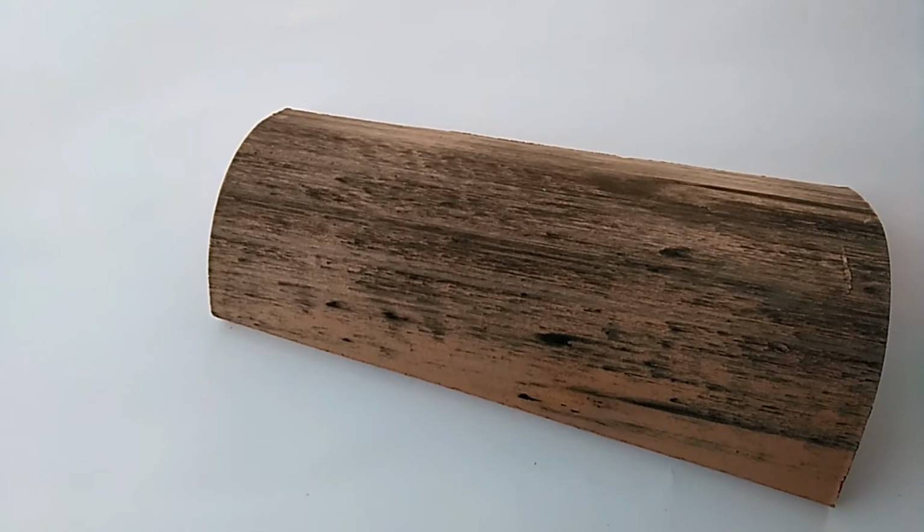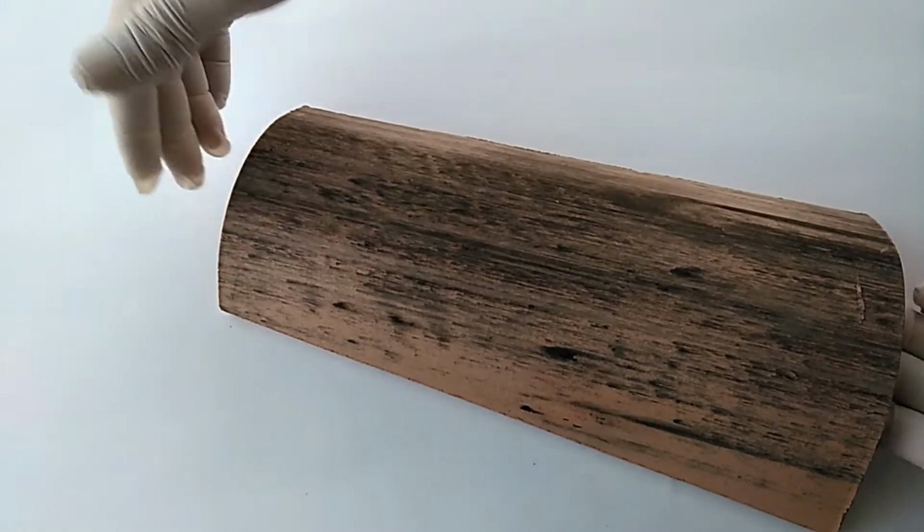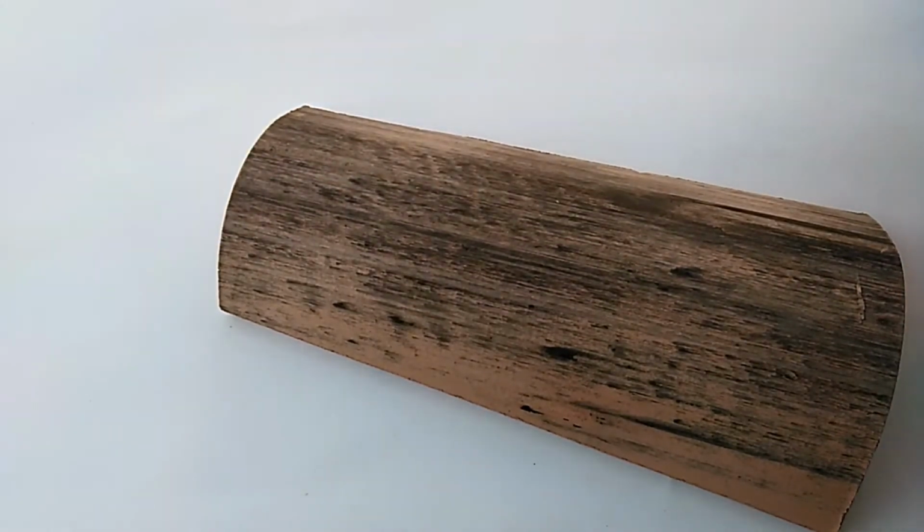As you can see here we have some tiles. We are going to give them a white rubber primer, also known as anti-leaks. In this case we apply the primer with a foam rubber roller that does not lose hair. As you can see the rubber is very dense, that's how we need it, so I do not recommend at all that you dilute it.